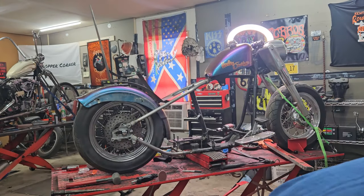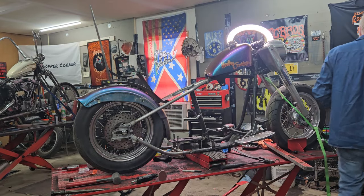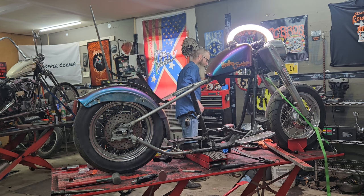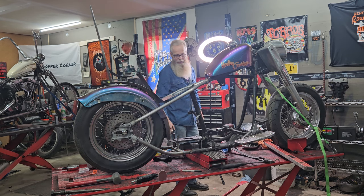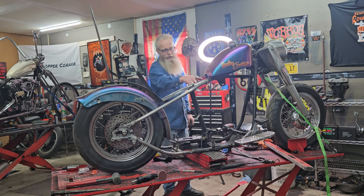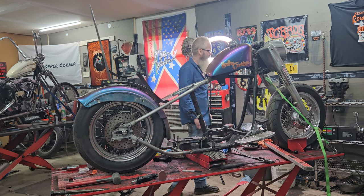I just want to keep putting parts and pieces on it, but every damn part and piece I put on it, I just got to take it right back off again. But I think I'm digging it. I could let the lift down, put the motor back in it. No, because I got to take everything off of it, carry this frame to work, TIG weld this frame up, because I'm just putting high heat, big old welds on there to tack it together. I wanted it TIG welded because that one we got at work, it'll just penetrate that steel so much better than that one that I got over there.